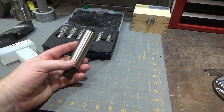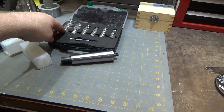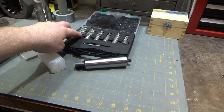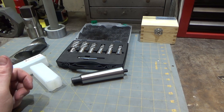I'm going to start with this — basically make a holder threaded 3/8-24 on the back, three-quarter on the front, with two set screws to match the Weldon flats. I've got some 1144 stress proof steel we're going to use and we'll get going.